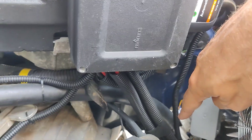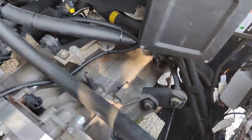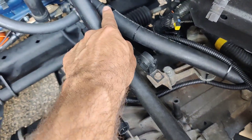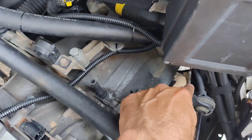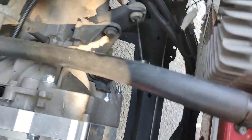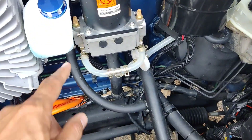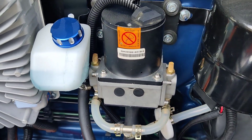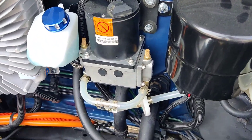This is a 2.7-kilowatt heater used for heating during winter. Below is the water pump — hot water goes out, cold water returns to the pump, and from the pump it goes back into the heater, continuously circulating.